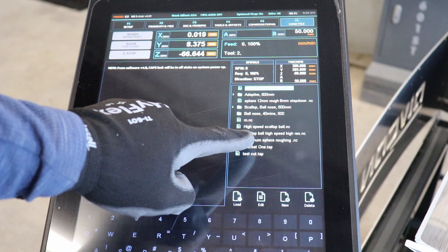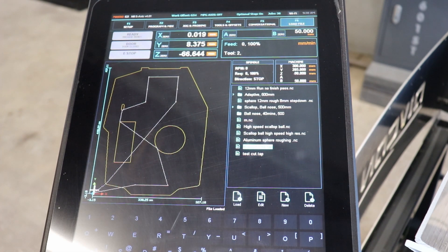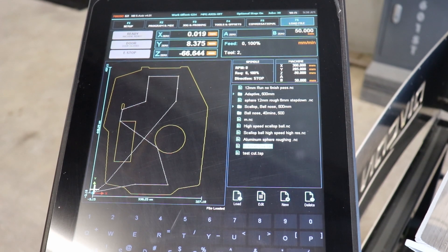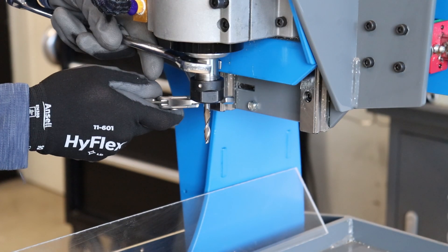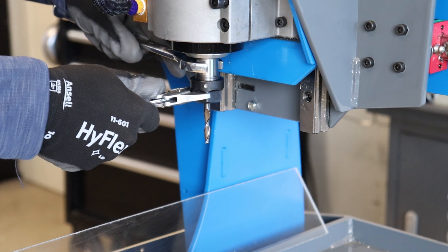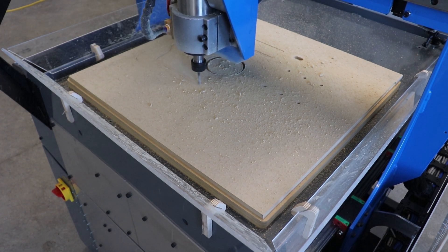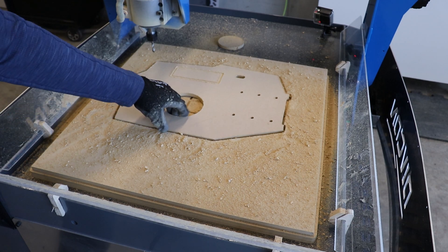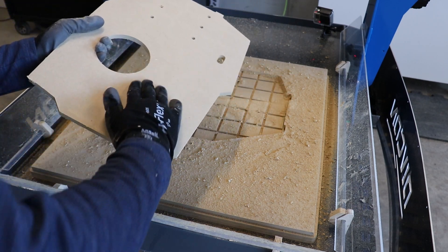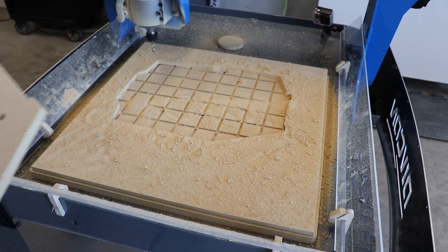I'll load some code, and this is just a complete nonsense cut with a few shapes and pockets that we'll be cutting from the ⅜-inch MDF sheet. I'm using a ¼-inch 2-flute upcut end mill for the cut. Obviously this is not a difficult cut by any means, but it allowed us to test the surface and learn the controller before we break something when we try and push it harder.